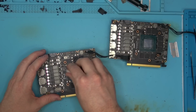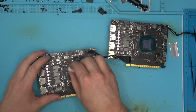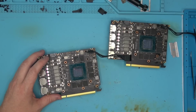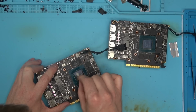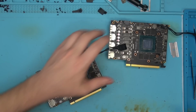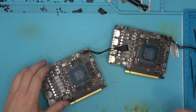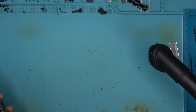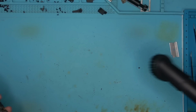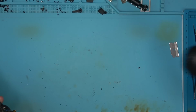That's kind of one of the ways to deal with the corroded cards. Once you've got it fixed and you think you're all done, throw it into the ultrasonic cleaner, and what you're doing is you're basically speeding up the process of eating away whatever extremely thin layers of either solder or copper had been corroded. So you're going to speed up that process of eating it away, and eventually creating a problem that manifests itself a lot sooner than it would have otherwise. So you're basically doing yourself a favor to prevent a potential return and a warranty repair.